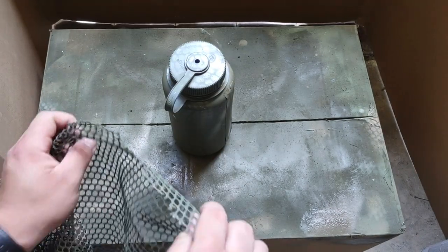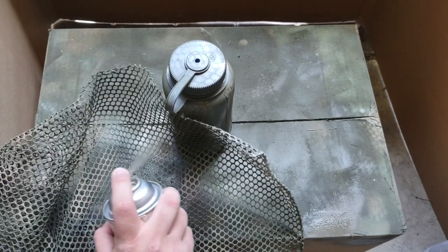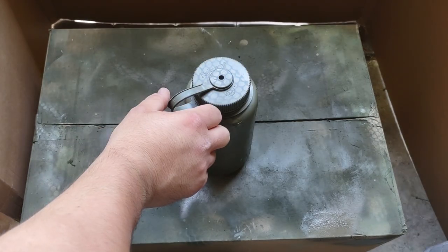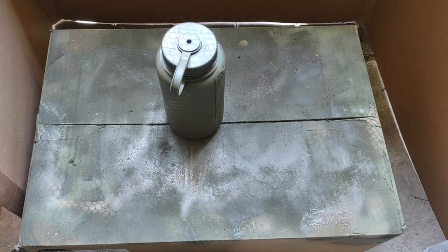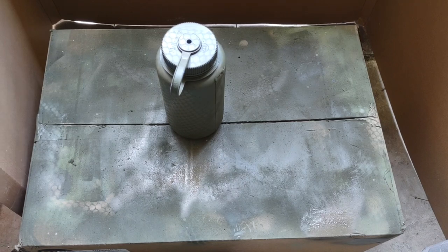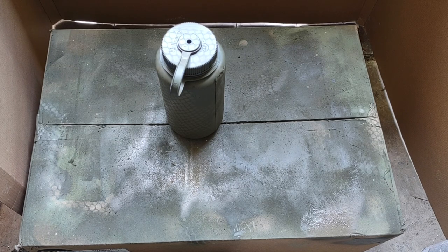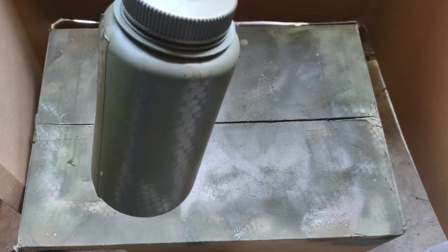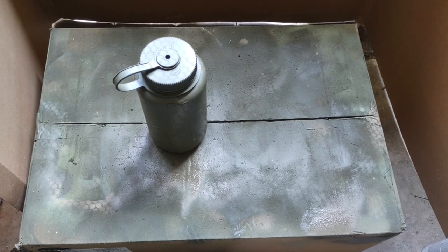Sometimes you can cut up a little square and kind of press it up against the surface. As you can see here — I live by an airbase — me being impatient, you can already start seeing paint coming off where I keep grabbing the handle. That's just because I'm impatient. I'm doing this as a demo — you really should follow whatever instructions are on the can for curing. That said, just because you smudged it a little doesn't mean you should strip all the paint and go back to square one.